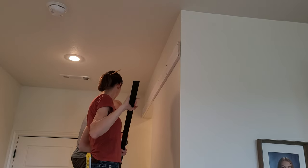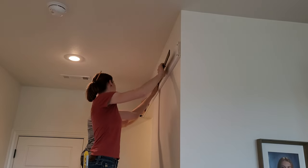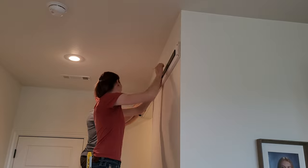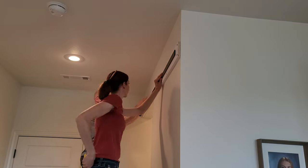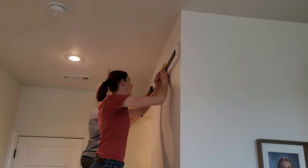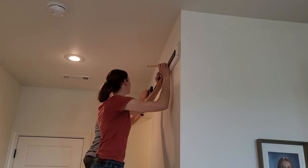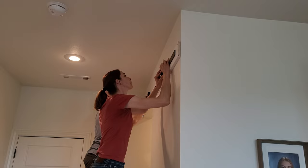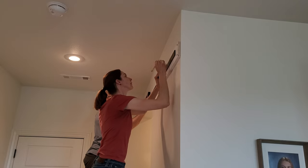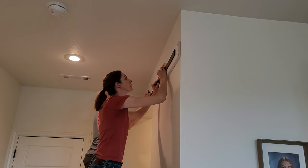The hardware we purchased was seven foot hardware, which came in two rails that connect in the center. Having two people do this part helps. We held up the rail — each with a level — and lined up the line through the center of the holes in the rail, then drew a circle around each hole. That helped us know exactly where we needed to drill our pilot holes to attach the rail to the header board.